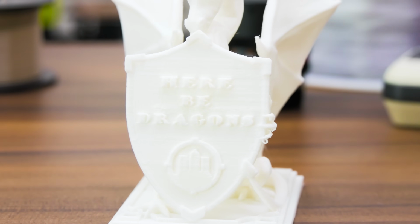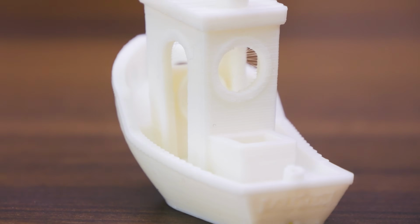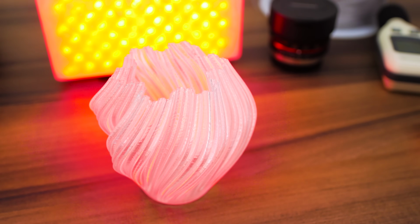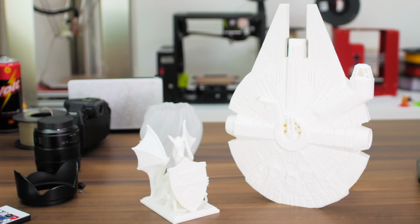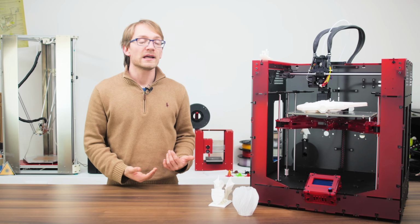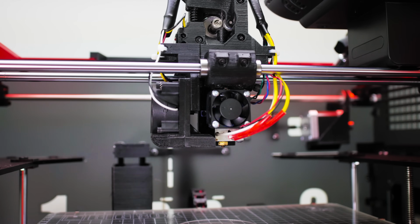Now, I did ask in the last video whether I should standardize my testing with Make Magazine's test parts, but the problem with those or most other objective measuring methods is that 90% of the quality they're measuring is completely dependent on your slicer settings, and those are something you can tweak and the manufacturer will likely also update as the machine matures. And to be fair, as long as the motion platform, hot end, heated bed and electronics are all solid by themselves, with the right slicer and firmware settings, the printer in its entirety will also print really well. Which is what I try to look out for, since the hardware is not as easily updated over the air as a slicer profile. And in that regard, the Big Box is well set up.